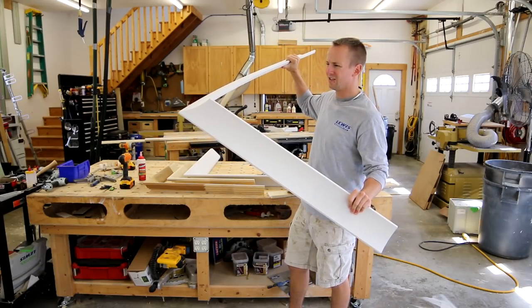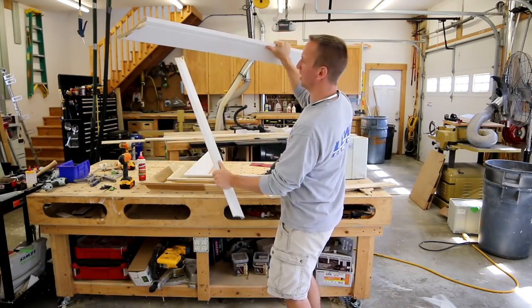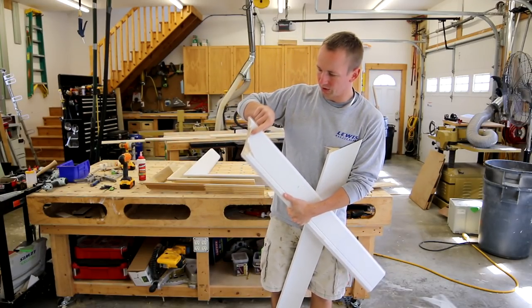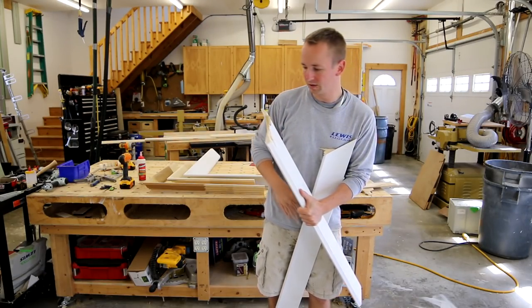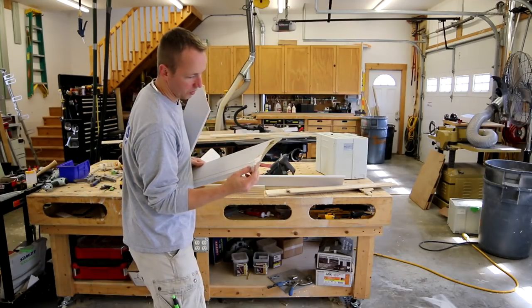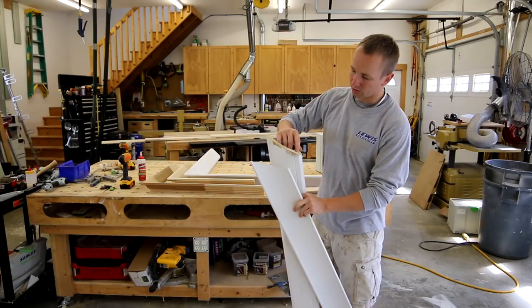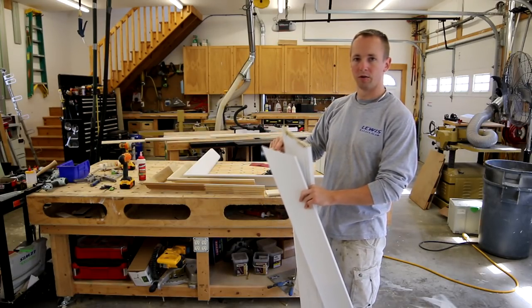This is five and a quarter crown. I'm going to try to flex it — again, very strong. You'll also notice where the dowel is, the wood broke in front of the dowel off the other piece. Same thing on this side — the dowel is down here and all that wood broke off. The real key to the strength of this joint isn't necessarily the glue on the end grain itself, because there's really not that much surface area. The key is getting that dowel on the backside.